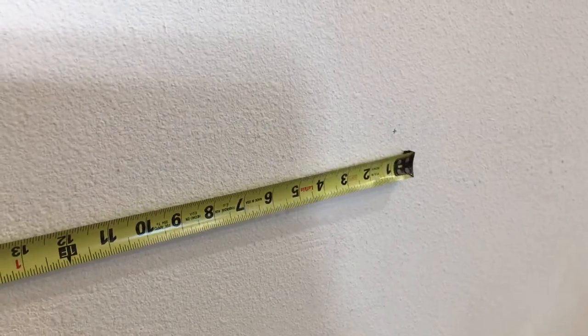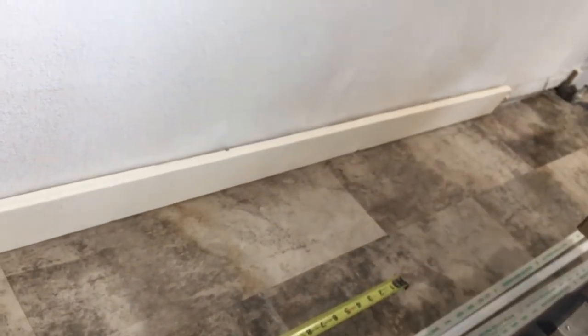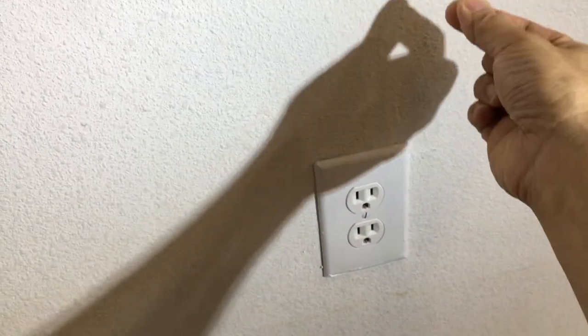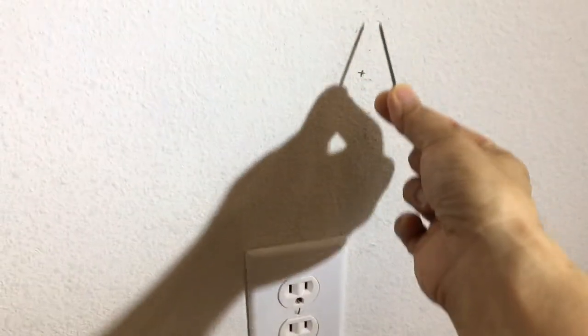See that mark there? That's also 24 inches. And so this is basically how you can tell where the stud is in the wall. So that way, when you go ahead and reattach the baseboard, like so, once you go ahead and reattach the baseboard, we'll be driving some screws through the wood here, and then basically where the stud is, where that cross mark is, just measure straight line down